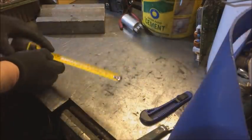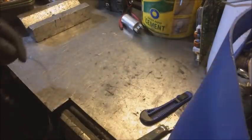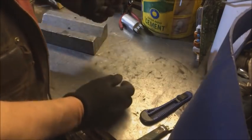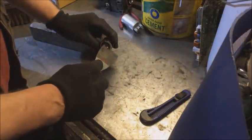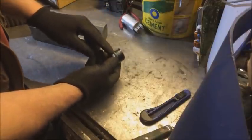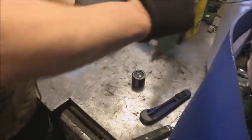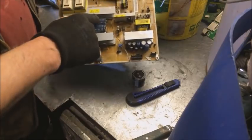Right, let's start off with what we've got. We're talking about roughly a foot by 20 inches of workspace — I've got to work in until I get rid of the stuff. The capacitor — you see them on plenty of circuit boards. There's a circuit board and that's a very similar capacitor. Take it off — always make sure you've grounded them, you don't want a nasty shot. That one for example is 450 volt, 220 microfarads, and you can get much bigger and much smaller ones.